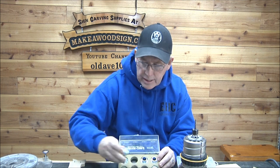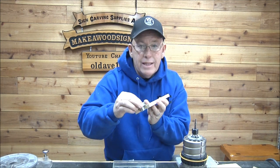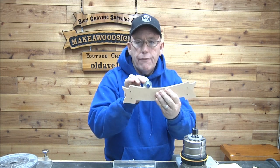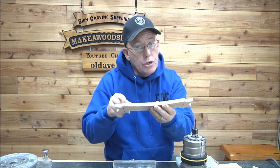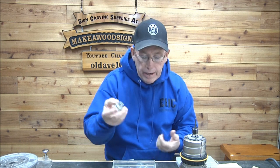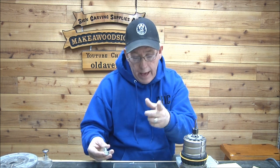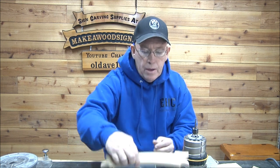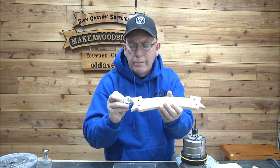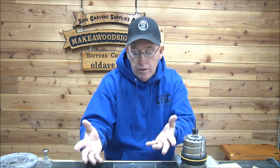Why are there other sizes in the template guide set? If you wanted to make the shape a little bigger or a lot bigger, you'd use a larger template guide — it would just be further away from the template, making a bigger version. You could use the same cutout pattern and make them bigger if you have the full set. I use the three-eighths because it's the best size to keep things close — it only cuts a little bit bigger than the template, maybe a sixteenth of an inch.